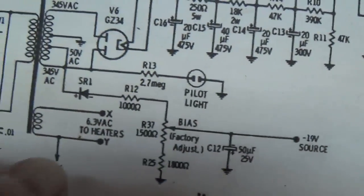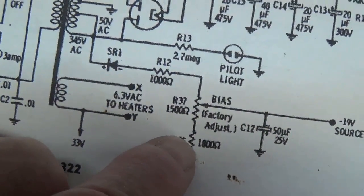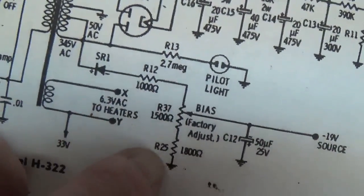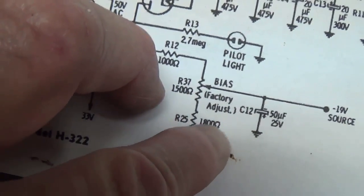So we're going to have to go back into our circuit and I think alter the value of this resistor so that we have higher voltage going this way toward our grids, rather than going to ground. Now the way to do that, of course, is to increase the value of this resistor. Now look in here at the circuit. It seems like I'm not the first person to think those are biased a little high. Remember, this was supposed to be 1800 ohms. Well, look what's already in here, 2200 ohms to ground. So I'm going to have to go up even higher than that.